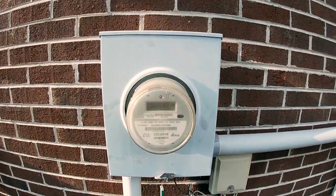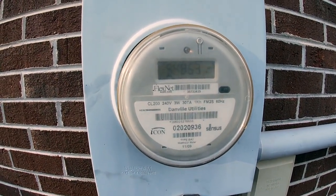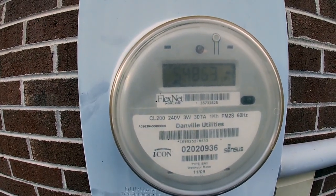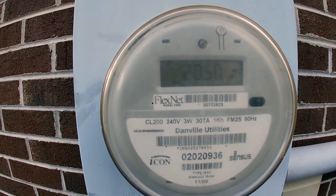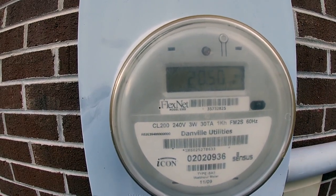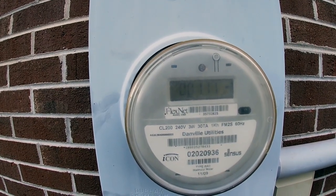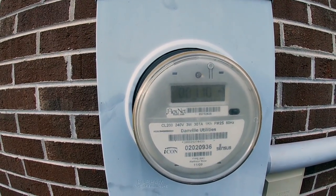So I'm going to bring you over here and show you. This is up at Dad's — we just had his Generac put in. If you watch these numbers come by, you will see that's kilowatt hours — that's the number the power company reads. And then this one here, the 20.50 kW — that number is the peak draw demand from this house. That means that is the most power that has ever been drawn out of this house at one point in time.